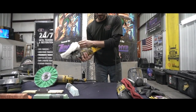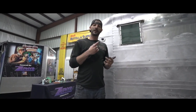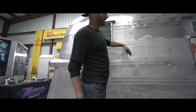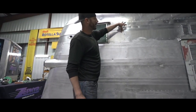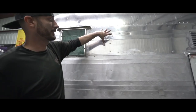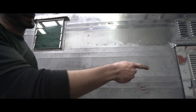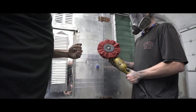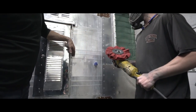First, we need to analyze our surface. We've already sanded this section down — stripped all the clear coat and sanded it with the DA. But up here there's a factory clear coat from back in the day. So we'll grab the easy prep wheel from Zephyr — it's our satin buff — set it at about 2,200 RPMs and pull backwards. It'll strip all the clear coat real easy right here in the square.